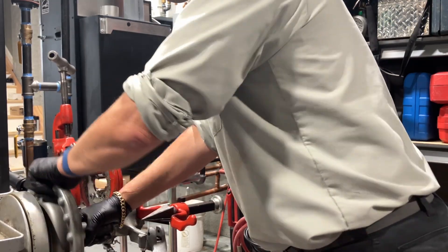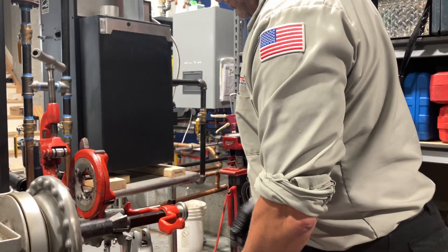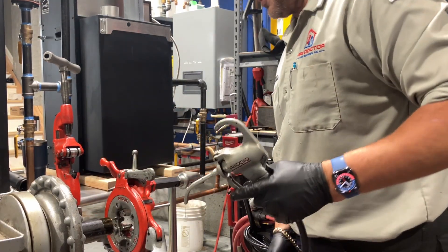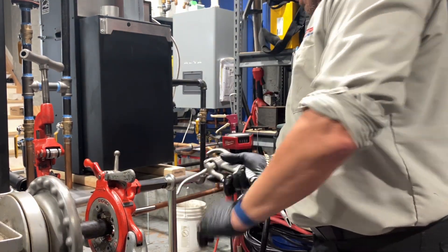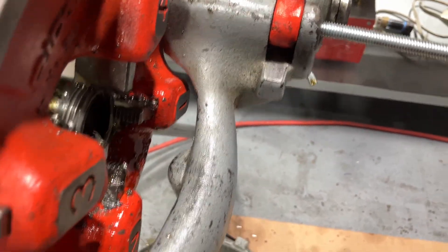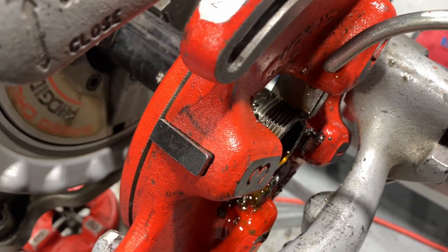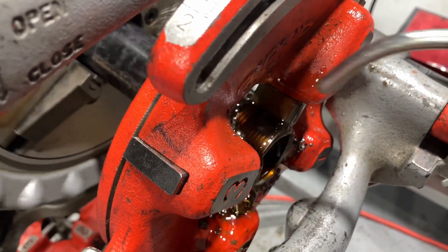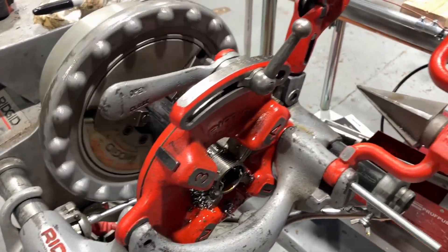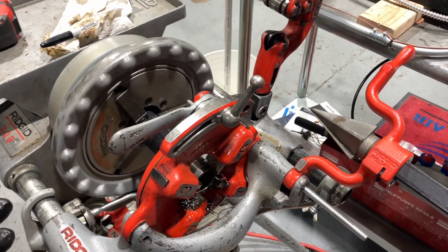Let's prep this end now. I'm going to squirt a little bit of oil on the end of the threads and bring down the die — it's already set to inch and a quarter. Once the machine is fully stopped, don't try to do anything while it's still spinning. I always back it out completely in reverse rather than popping it open — that's the way I was taught decades ago and that's the way I still do it now.